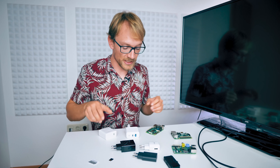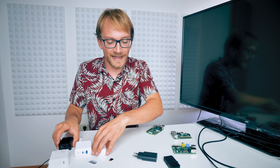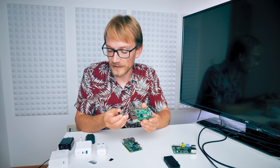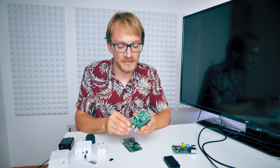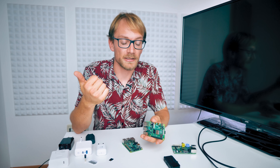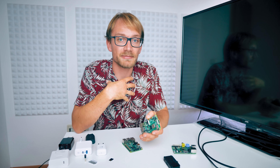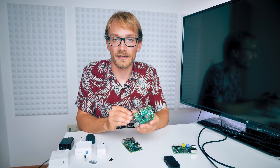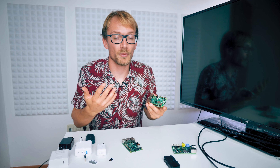Closing thoughts on the Raspberry Pi 4: is it as buggy and as bad as some people seem to portray it? I don't think so — I think it's actually a really good board. The two issues that are very real — overtemperature and throttling — I've not gotten it to throttle in real applications, only in synthetic loads, so for your typical workload it's totally adequate.